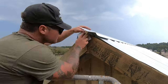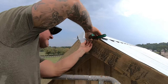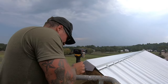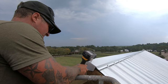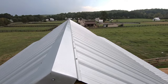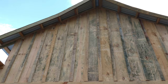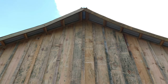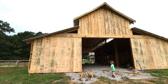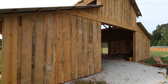I tried to get the box rake to fit or bend on this arch gable and it just was not happening without looking like Edward Scissorhands took a whack at it. If you guys have any suggestions on what I can use to trim out this arched gable, please let me know. Here's the ridge cap after we trimmed it up and got it nice and neat and tucked away. We've got about two weeks of work in this siding job so far and about 80% left to go — most of the batten still to put on, a lot of trim work on the corners, and the monitor section still to fill in with custom vintage windows.